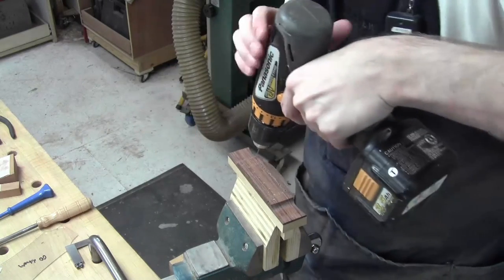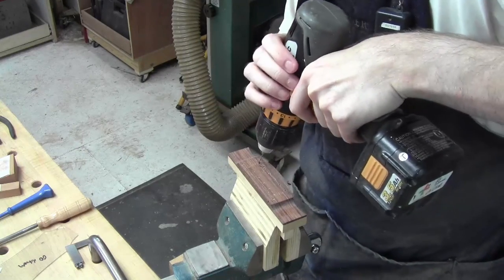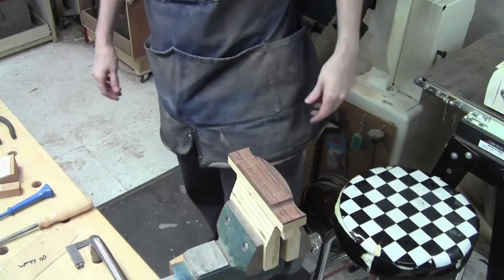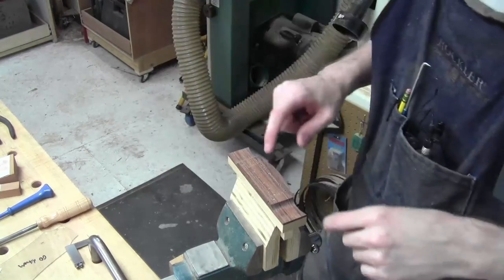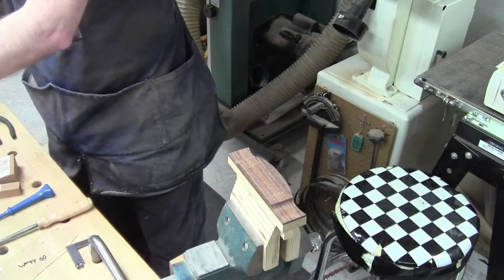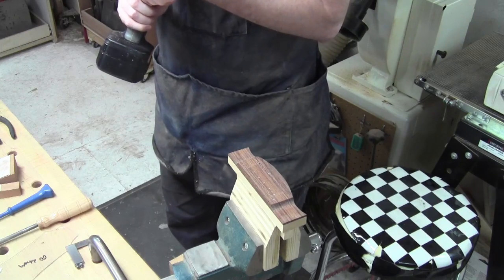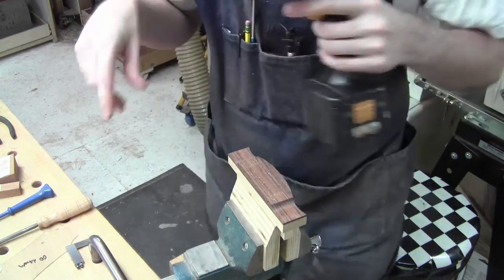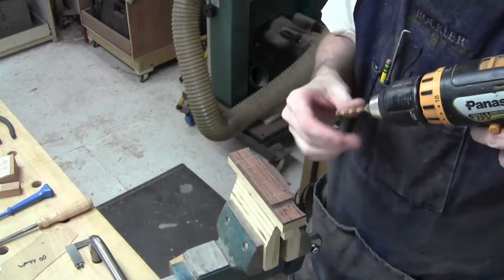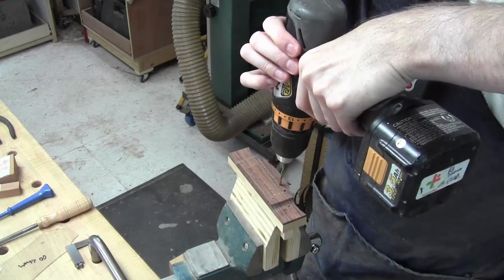As far as the CNC is concerned it's just material, and you don't get as much of a feel for what works with the wood itself. Also, I kind of just want to do it this way. I've got the sixteenth-inch holes started; I'm going to finish them in eighths because I have eighth-inch pins I use to locate the bridge to the body later. Hoffman does them in three-sixteenths but I'm going to start with eighth.